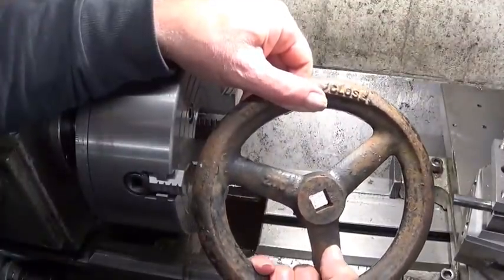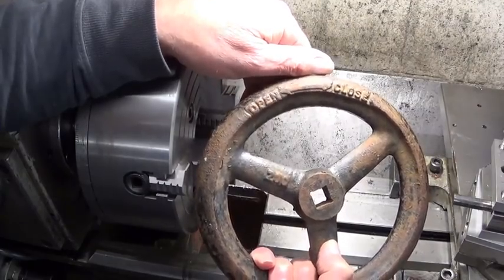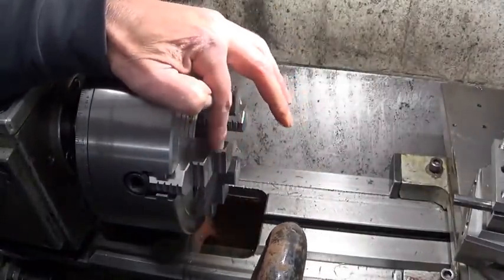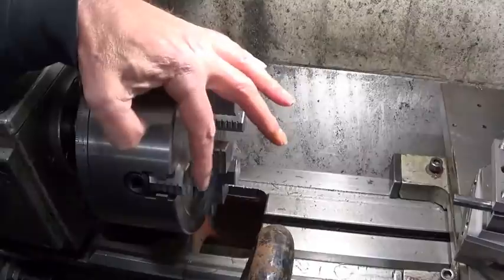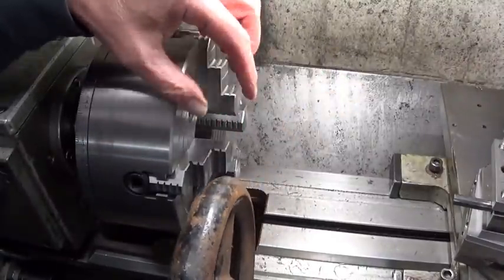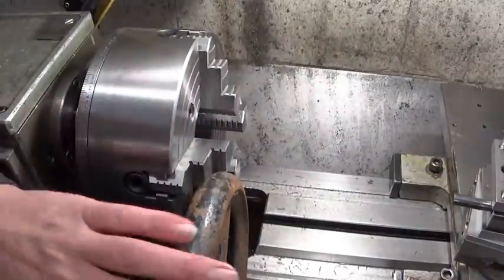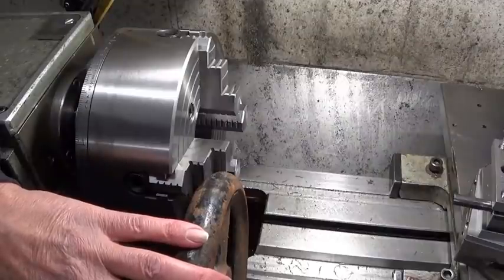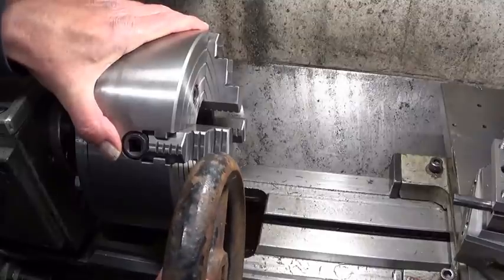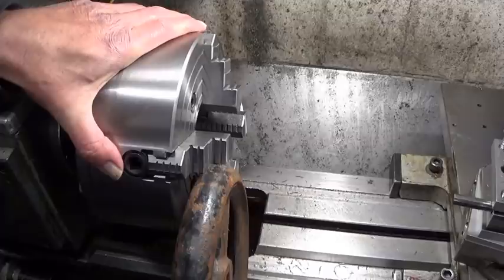It's flywheel time, but there is a little problem. I have here this jaw is 11 and a half millimeter step, and here too, and this one is 26. So the center line of my part will be out of the jaws. No way to hold it like this. That's not gonna work. So, I'm gonna find another solution.